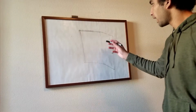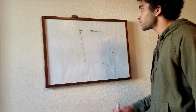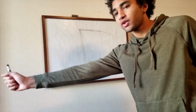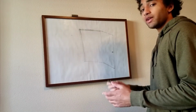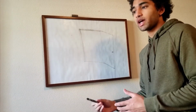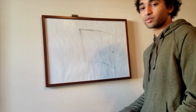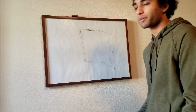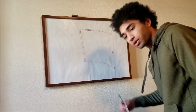So right here I have a door and a door frame. Typically on door frames there is a small lip around the door frame that prevents the door from going further than the door frame itself when you close the door. I plan on utilizing this small lip to create some sort of switch that will trigger pin 11 on my Raspberry Pi, as shown before. This switch will be created from this aluminum tape or some aluminum foil.